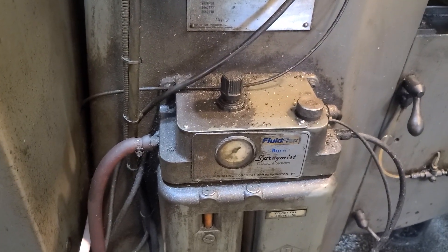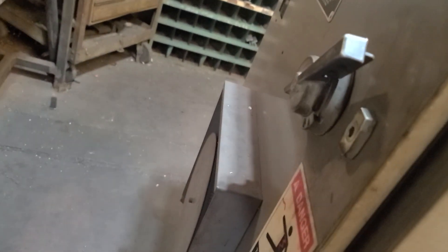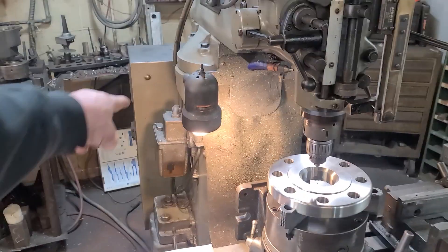There's your mister — it's got fluid in it. You've got way lube. Just reach back behind here and fire this dude up — boom. There's an air cleaner; you got to blow out down there every now and then. And do not ever take the floppy out — it's a big floppy. Don't take it out, leave it in there, because it boots off the floppy. So give the way lube a pump.